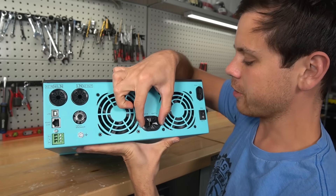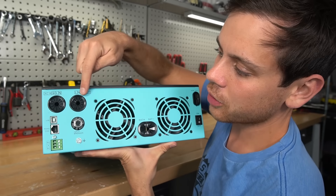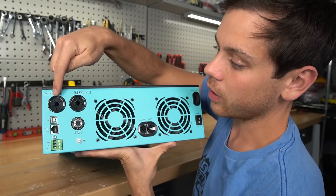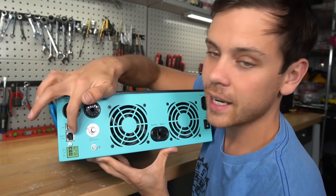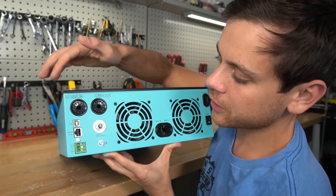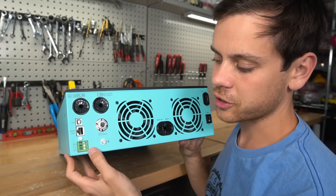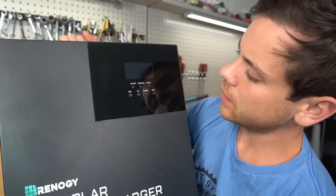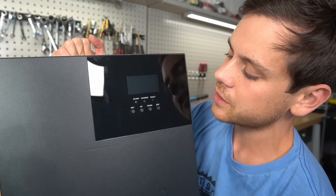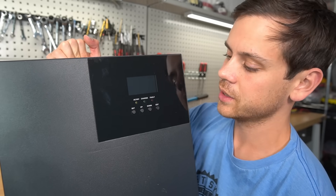On the bottom we connect the battery, the PV input, the AC output, and the AC input. You can also monitor and log with the USB and it has CAN communication. There's a main circuit breaker for the AC output and a generator input so you can start it and charge up your batteries. It also has a ground connection when appropriate. On the top we have a screen with a very similar screen and button configuration as other all-in-one systems.